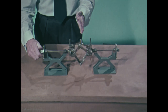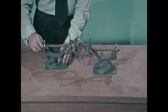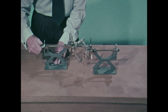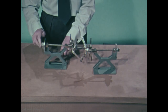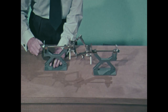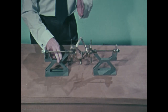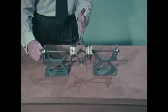Let me try to explain. When the shafts are in line, there's a plane of symmetry across the middle of the coupling. But two parallel shafts do not intersect except at infinity. If then there is to be a plane of symmetry, and if this plane of symmetry has to pass through the point where the shafts intersect, any plane of symmetry in a parallel shaft coupling must somehow be imagined at infinity, not anywhere in the finitely accessible region. This then is the root of the trouble. When the shafts are in line, the coupling of itself cannot distinguish between the plane of symmetry here across the middle and the other imagined plane of symmetry at infinity.